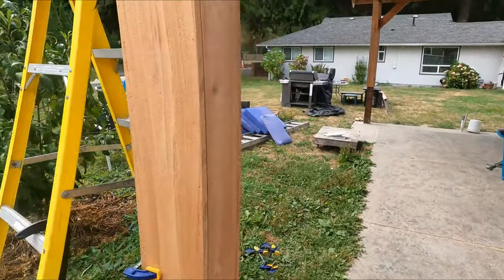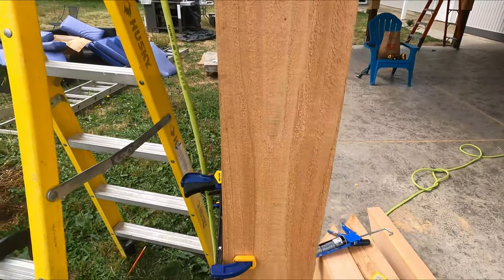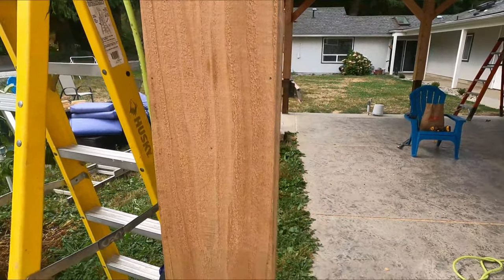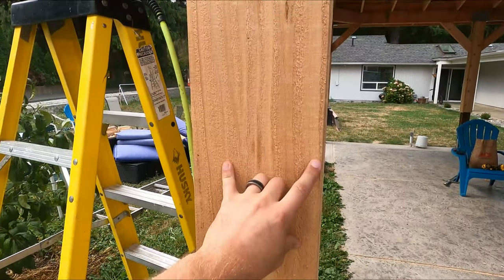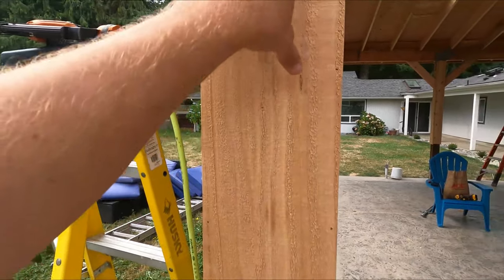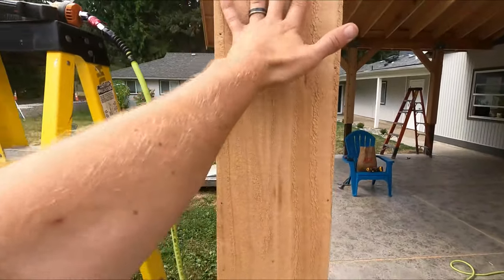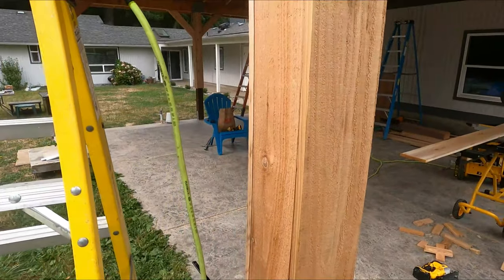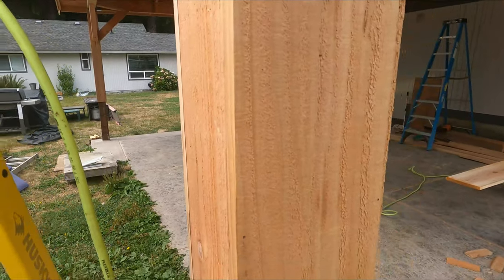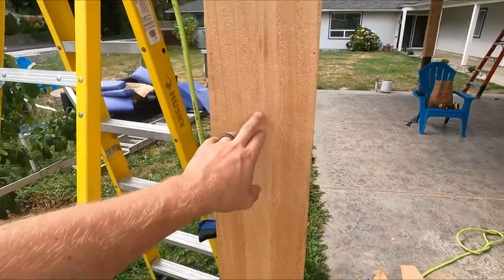And then I've been using both construction adhesive, wood construction adhesive, and a finishing nailer, because these finish nails aren't going to be the best hold, especially outside in weather conditions, sun and rain. Cedar does like to warp out a little bit when it's this thin. So I've been going both methods to try to hold it flat as possible with as much as I can get. And I don't want to put a big headed nail in it because you're going to see all of those.